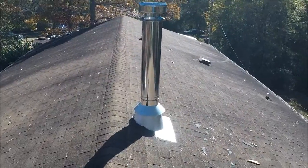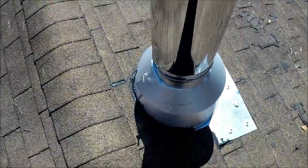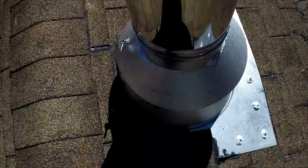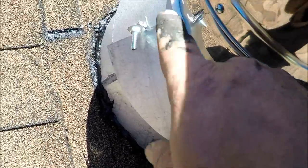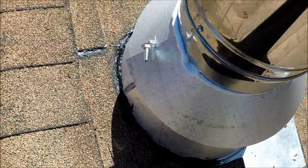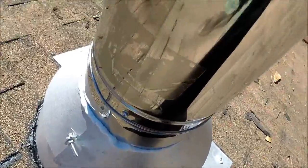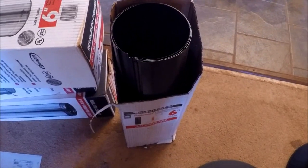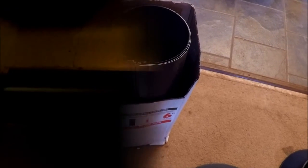The scary part is done. I've got the chimney up. I've gone ahead and put caulk over all the screw heads, a little bit right in there where this storm collar meets the pipe. And then I've even taken a screw and put it into the pipe — a short screw — just to anchor the two together. Starting with single-wall chimney pipe; I'd like to get a telescoping double-wall maybe next year.